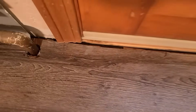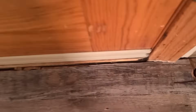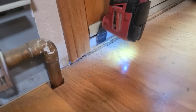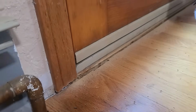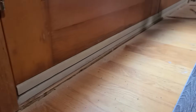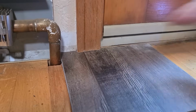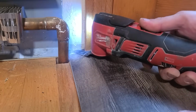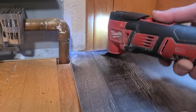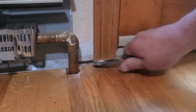Now another patio door that I'm working on, you can see that gap there at the casing. This is a patio door that's flush with the sheetrock, and if you don't get this cut in correctly, you're going to have these gaps on the casing, and the quarter round will not cover that. Now this particular patio door had a base plate underneath it that was made of wood. I cut it flush with the threshold, and now what I'm going to do is notch out past both sides of the casing on the right side of that casing right there, and then I'm also going to cut some of the sheetrock away just so I can slide the plank in and get a little bit more room in there, so I make sure that everything fits in there nice and loosely, and also so that I don't have any gaps when I cover it with the trim.